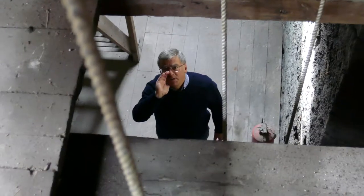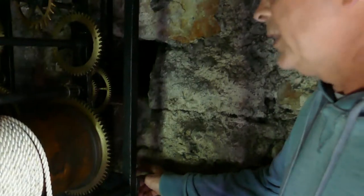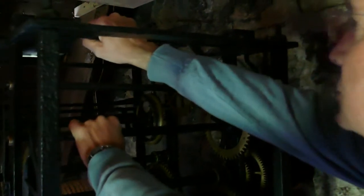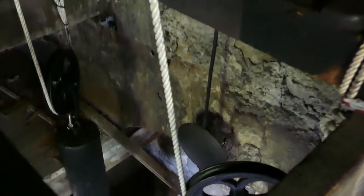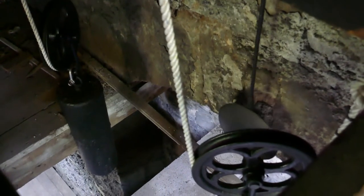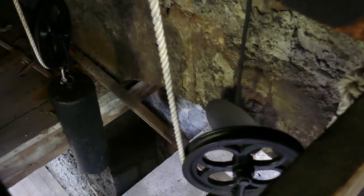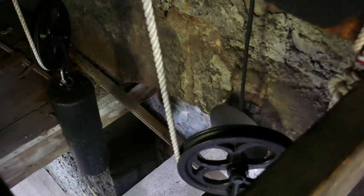The clock's running three minutes slow — okay, plus three minutes. Just stop the pendulum. I take a good hold of this so it doesn't run away from me, disconnect the mechanism, allow that to run forward by three notches, which is three minutes. Make sure that's fully engaged and then just restart the pendulum. And the pulse of the village starts once again. Now you think how many times that pendulum has ticked and tocked since Hogmanay 1731 — that's an interesting calculation.